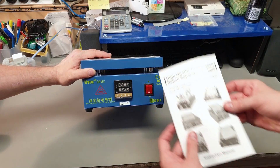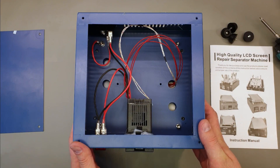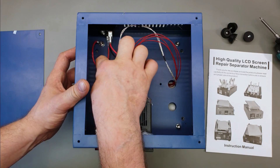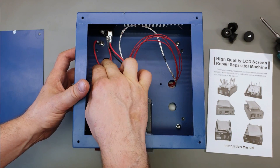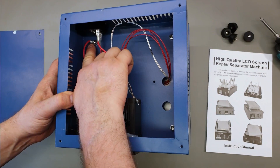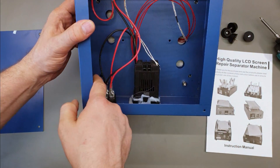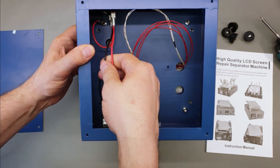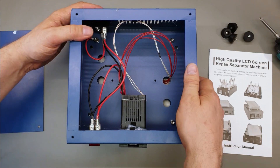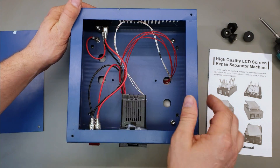There's not a lot of literature on that online, and the instructions are basically just how to set the temperature - pretty basic. Looking at the electrical side of things, we've got the earth wire here. They've used red; I'd like to see green or yellow here, but it is connected - crimped and pushed onto the faston terminal on the IEC socket, and it's soldered to the crimp and bolted down nice and firm. That is earthed very well. Also, if you look at the power switch, we've got black and red - it turns out they're switching both the active and the neutral, so when you turn this off it completely cuts power to the unit. If your active and neutral were swapped around, this will still isolate regardless. A nice little touch.